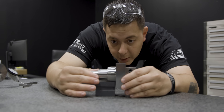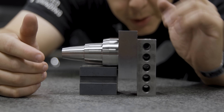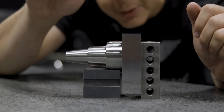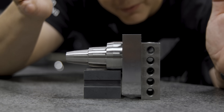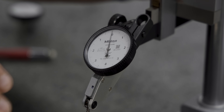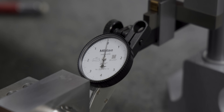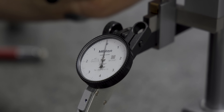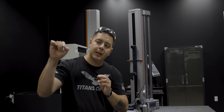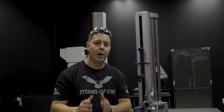I'm supporting the part on a journal with a back plate to hold it straight. Then I'm going to tram this top to make sure it's square — and in theory, if it's square, then when I run an indicator up the sides it shouldn't move. I trammed the top on each side, then ran my indicator up and down the part, and as you can see that needle is not moving. That proves that each corner is 90 degrees — and when I did each side, it's a perfect square. On a cylindrical grinder, we were able to grind a perfect square.